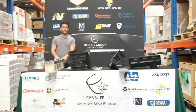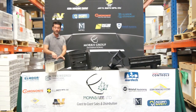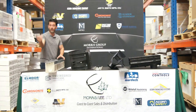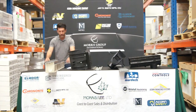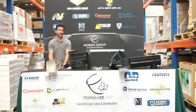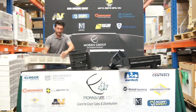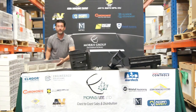The next system JR Smith can offer is the six inch wide polymer cement, known as the 9895. This system comes with an integral rail embedded directly inside the channel. You can also get it in stainless steel or ductile iron rail for extra heavy duty applications such as car or forklift traffic. It doesn't have anchor tabs or rebar clips on the side, but you can use an installation device which holds the channel off the ground — essentially a pitched fork into the ground. Each channel has ribs which the cement fills up, preventing it from shifting after the pour.